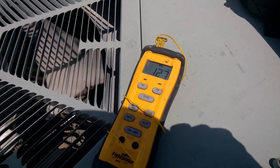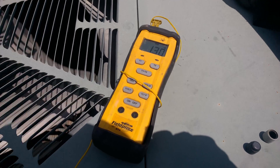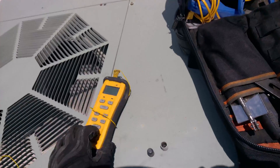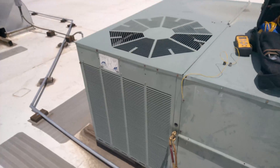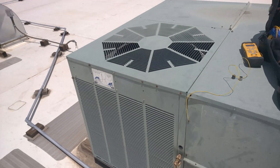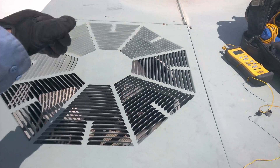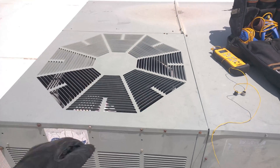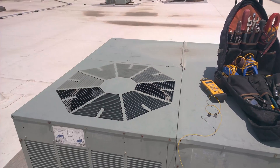There's 127. There's 130 right there. It's like somebody didn't check their universal fan motor after they started it back up. It's still moving air so I guess it was online, but it's not too efficient when your blades are spinning the wrong way — it's going to push air down rather than draft the hot air up.